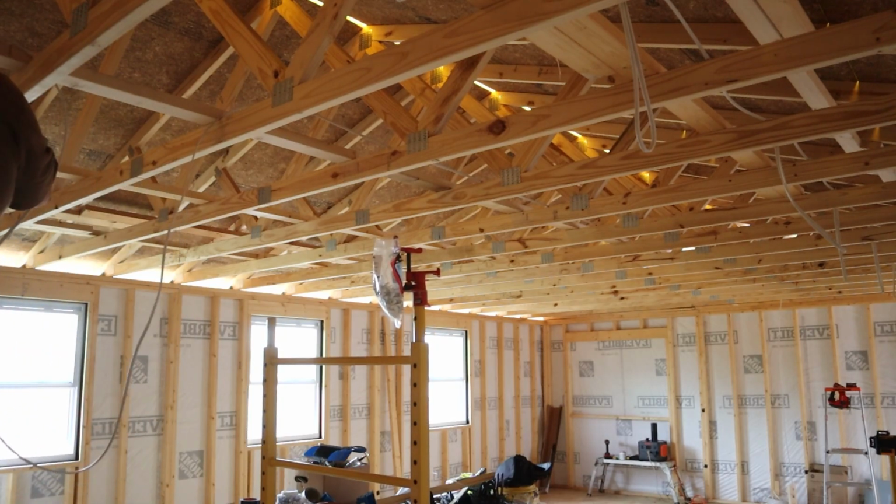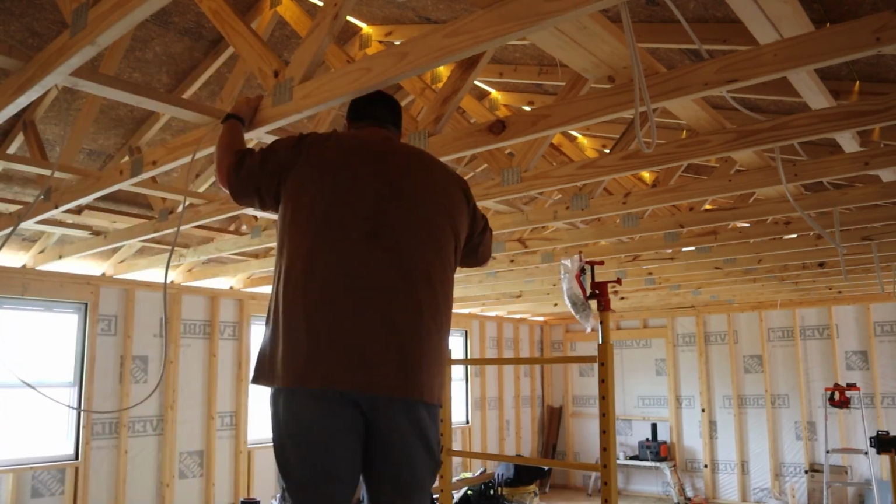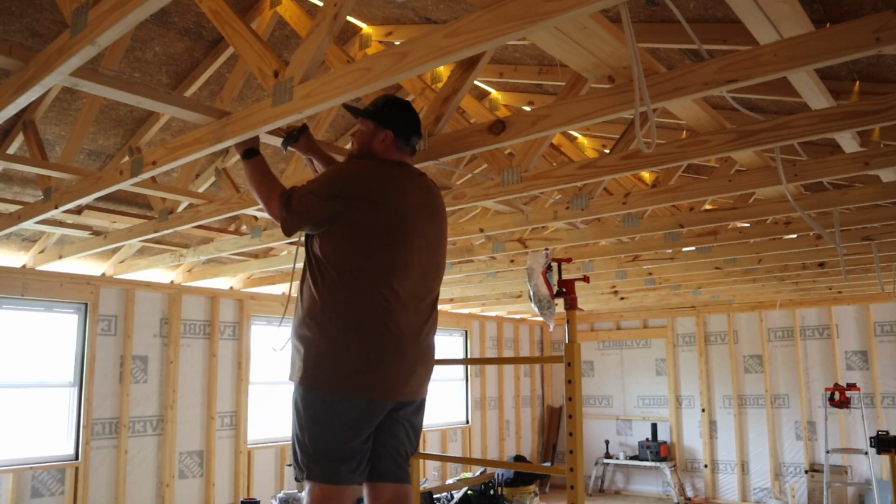So the way that I'm pulling these wire runs is I'm starting with my reel back there at the sub panel, taking the wire and dragging it all the way across the room, letting it unspool from the little homemade wire spooler unreeler thing that I built, get it all the way to the wall, then I take it back, go up, in, above, inside the trusses, and then work my way all the way down through to the end and start stapling it from there.